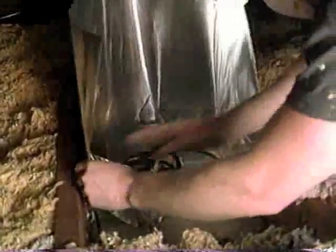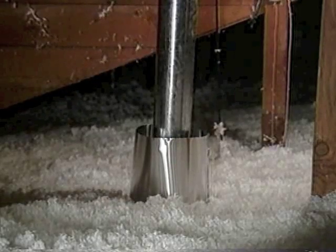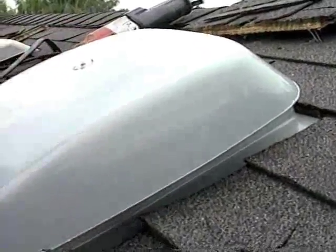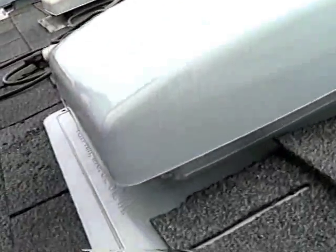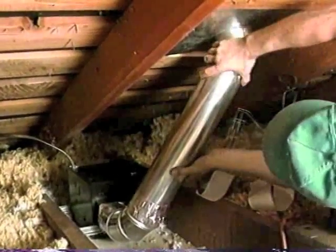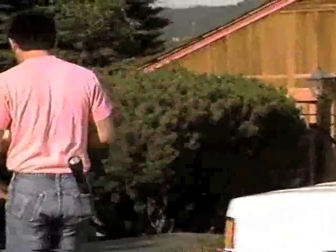It means looking after details like reconnecting loose ducts, cutting water pipe insulation to fit tight, and weather stripping access hatches. Some of the things you do have a big effect on the health and safety of the occupants, like protecting heat-producing fixtures, or keeping insulation away from chimneys and flues, or making sure the roof vent doesn't become a roof leak. It may take a little longer doing it right the first time, but a lot less time than doing it over again. A utility inspector may check your work.